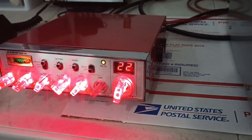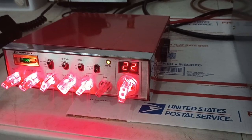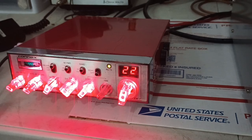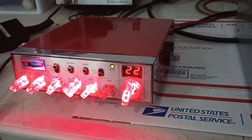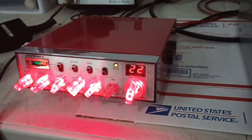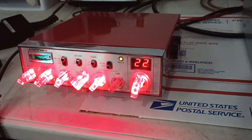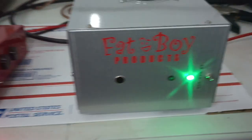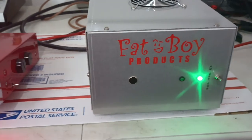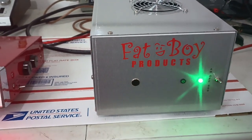As far as average power, if you use average power as a reference, we're putting about 20 watts average in. It could probably handle a little bit more. I'd go as far as to say 25 to 30 watts average. It's a modulated average power, if that's something you use as a reference. But about 50 watts PEP is what we're going to use. Again, you can put a little more in it, but you're probably going to get diminishing returns. 60 to 70 watts PEP going in, you'll see a little bit more out of it.